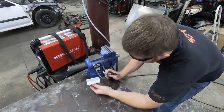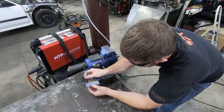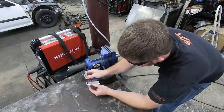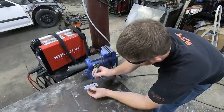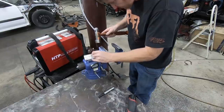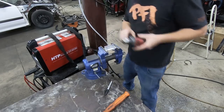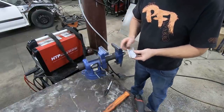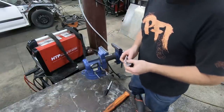Now that we're all cut - I've got this piece with one mark on it, which was the centerline for my two bolts. I just use my fingertip on the edge, line the sharpie up with it, scratch it over, then go to the other end for the other bolt so they both have a matching depth. There's one bracket - I'll take it over to the sander, round these two corners, clean it up a bit. That's one side and then we'll knock out the other side too.